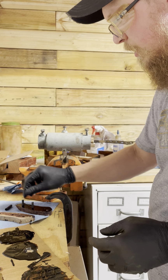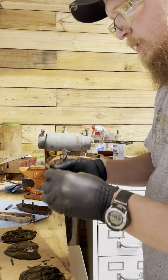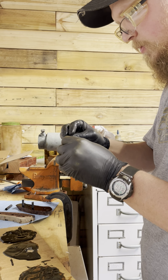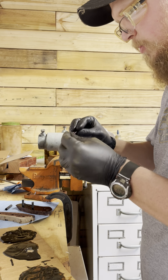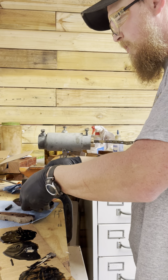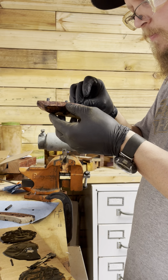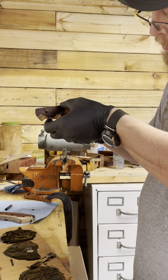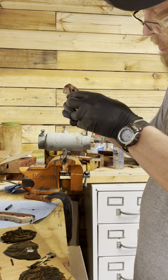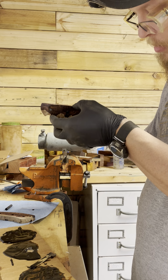So make sure you get epoxy in all the pins, not just one, so it fills in, because these pins are a quarter inch, and the holes themselves in the wood are just a little bit oversized. And that's another reason I like to use black pins, is you have black epoxy, they kind of blend in. You want to make sure you get it all the way through, working that epoxy. Now these pins are pretty flush with the outside.